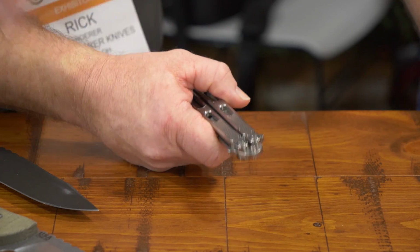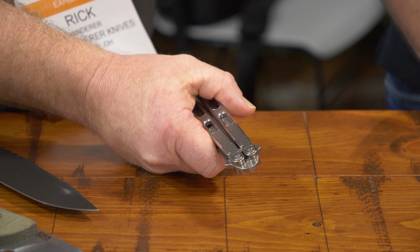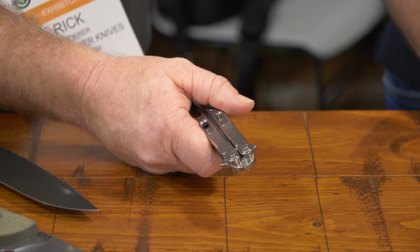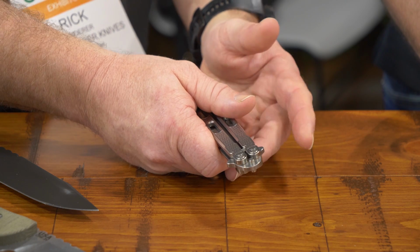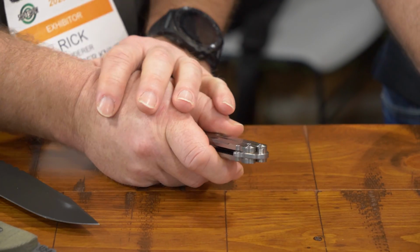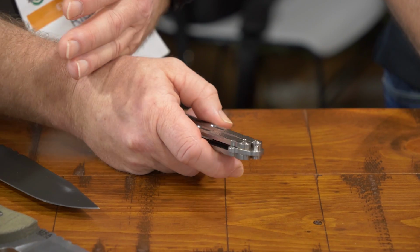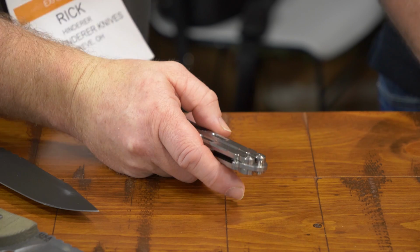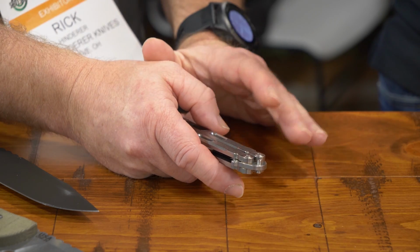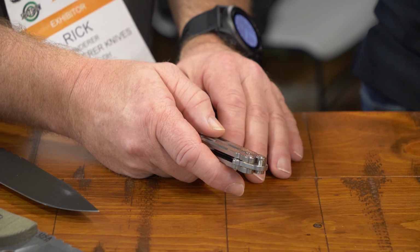When I decided to make this sandwich style Bali, I was told that industry standard is about 1 thou over blade thickness. Right. Okay, well, I did that, and I had some looseness in the handles. All of my people in the shop are very good at building knives, and our quality is absolutely fantastic across all of our knives. You can pull any XM18 off the shelf, and you're getting a good knife.